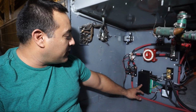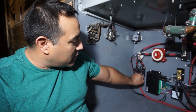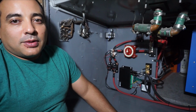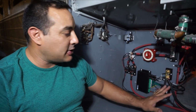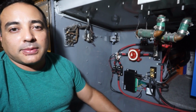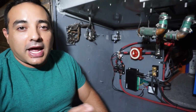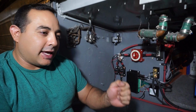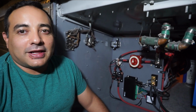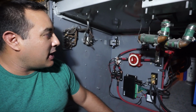We've got a display screen for this one, as well as a little piece that plugs in so we're able to program it with our computer. Same with the Victron, but we have a couple questions to ask because they have this thing called the VE bus, which is Victron's sort of proprietary bus. And the REC BMS is supposed to be compatible with that. They sent me a cable and everything, but I have to make sure there's a way that you can plug them in together, and then you have to terminate them. There's all this kind of weird stuff that I'm just figuring out. So I've got a little bit more research to do on that. But as far as wiring, I think we're pretty close.